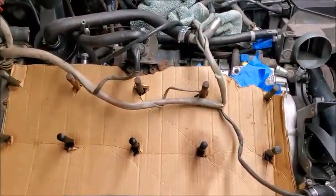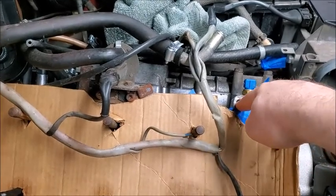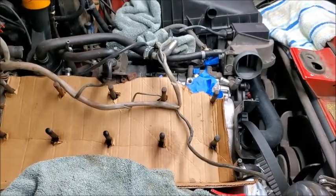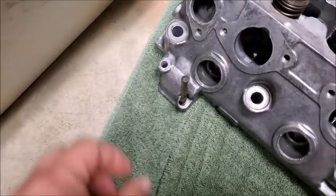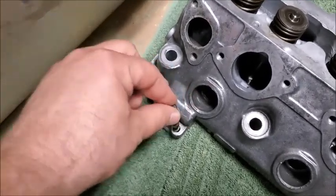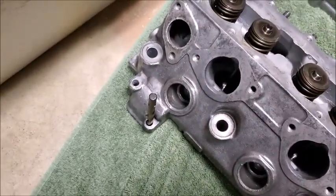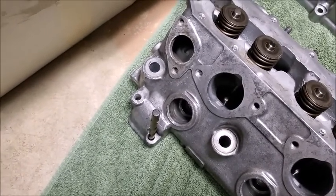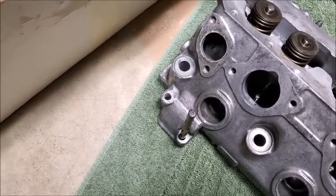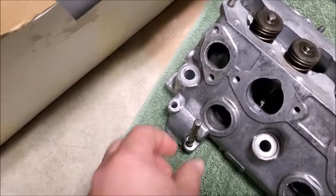What I think I'm going to do is put the head on and use that as a template for the hole to make sure that I drill correctly down in there. I'll have to see if the bit fits through the hole in the head. That's the hole it needs to go through — and it slides through and still has a little bit of wiggle room. I'll just have to be really careful not to hit those sides, but that'll give me a really good mark for the angle I need as I'm drilling down. I'll just have to go slow, but I think we're good to go on the drilling part.